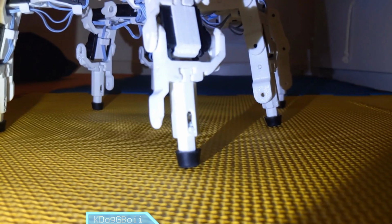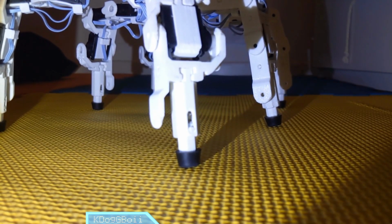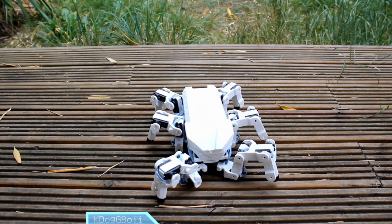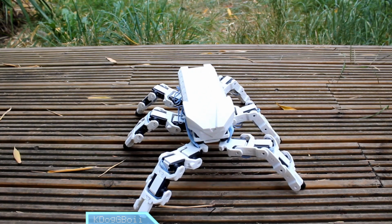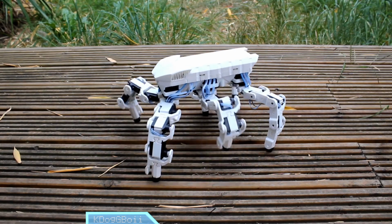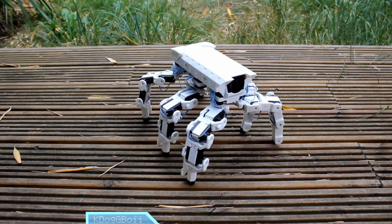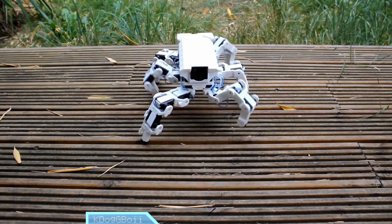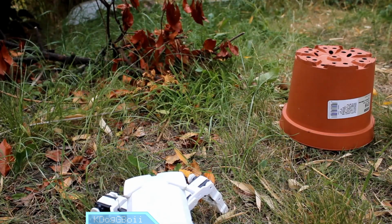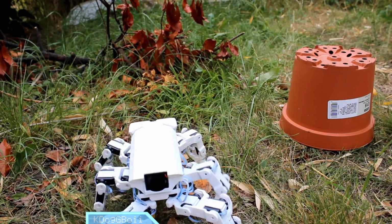Looking at real solutions to this problem, all pointed towards board relayout, and because I didn't want all of my effort on the homemade board to go to waste, I opted to manage the issue instead, by having the legs engage in smaller groups on startup, which means not only is Unit 0 startup animation cool, it's essential, for the dumbest reason possible. Even though the big startup gulp was managed, Unit 0 is still plagued by back EMF.